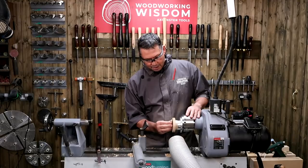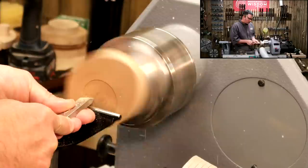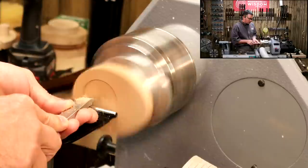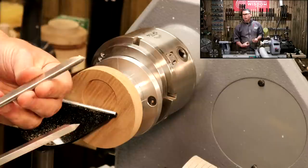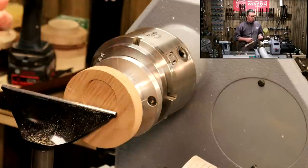That was the bit I measured earlier — it's getting close but I still need to take a little bit more away, so a little bit at a time. Now, you might be wondering why I'm not using the signature skew — the signature skew has these lovely radiused edges so it runs along the tool rest beautifully and rolls a bead nicely. But what we need is a nice 90-degree scrape in there, which requires a hard edge — so I need the flat surface of a standard skew, that's why I'm using that one.